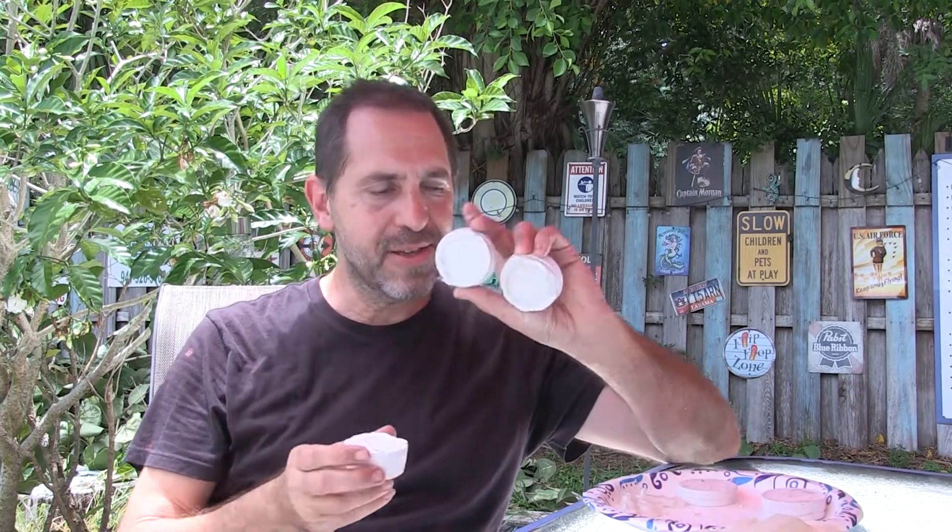Plaster can be made to work — I've done it — but it doesn't tolerate the heat as well. It can go down to 1200 degrees and be fine, but get much higher than that and it starts getting crumbly. So I'm experimenting. I've created these little pucks of different materials that I'm mixing, trying some that are 80% plaster, 20% something else. I'm going to throw these in the kiln in a little bit and see which one holds up the best.